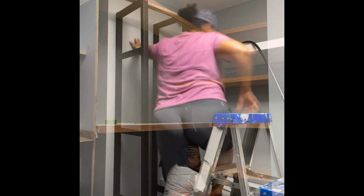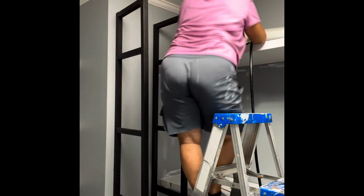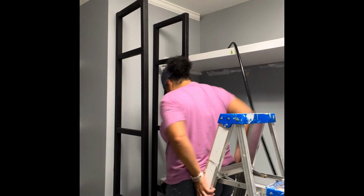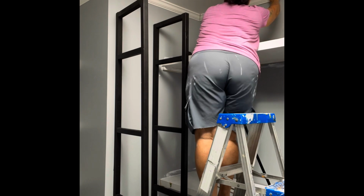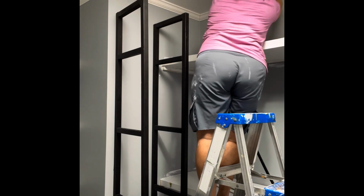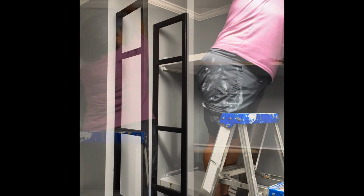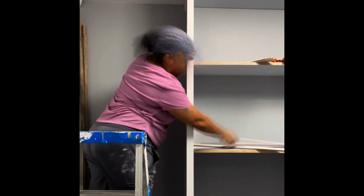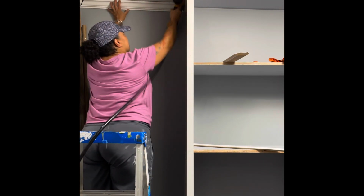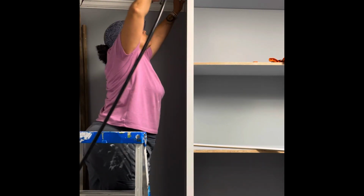Tedious. Okay, so now I'm getting to where I'm installing the crown molding, and this almost took me out. I came really close to contracting out this effort because figuring out the whole upside down and ceiling wall and 45-degree situation with crown molding was a lot, but I finally got the hang of it. And like they say, none of the corners were 90 degrees.